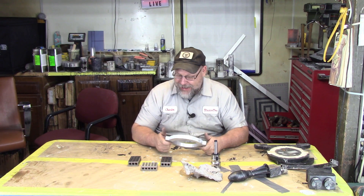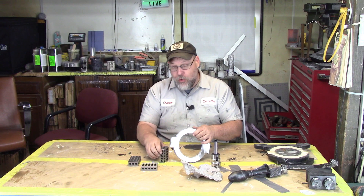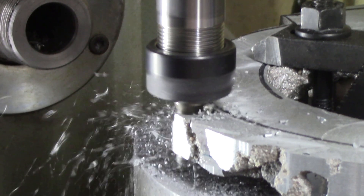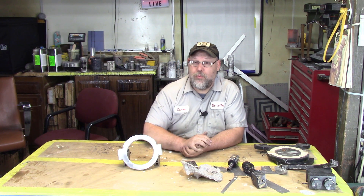I'm happy with the way it turned out. I just wasn't anticipating having to do this much work to clean up a part, but doing it I learned a lot — I learned the limitations of my milling machine and what improvements I need to make for future projects. It's always good to stress test your equipment. I learned to take lots of small bites; this machine likes small bites. It's not as rigid as it should be — upgrades are going to be done. It's always good to push equipment to the end and see what fails.